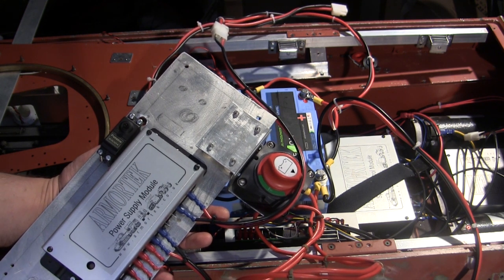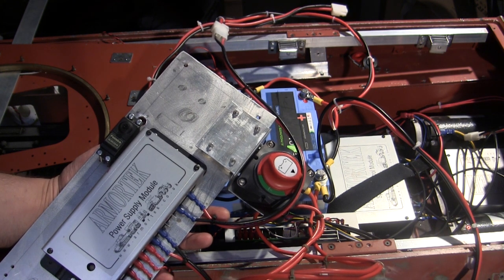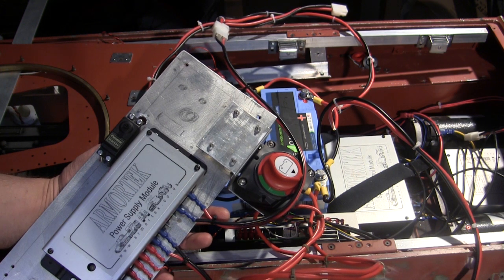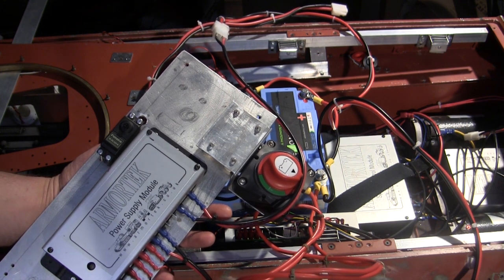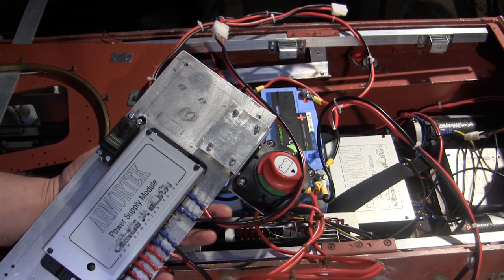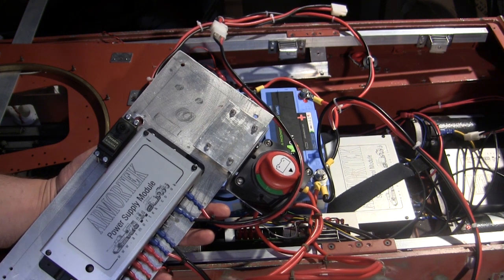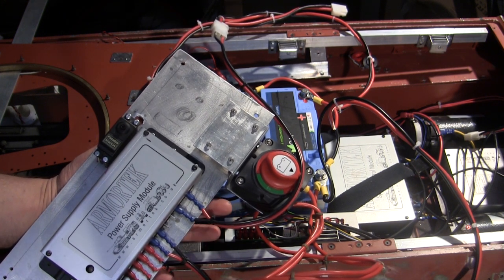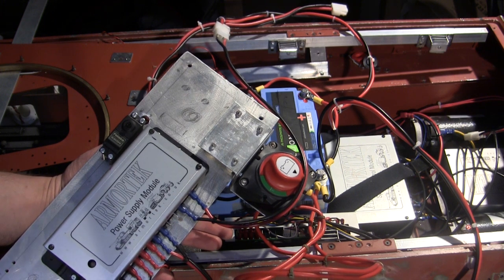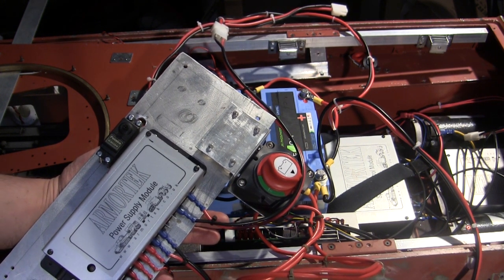Well, in case you accidentally nudge the lever on the radio but you don't want to run the tank with the lights on, there was a main kill switch here, so that would be prevented. However, in practice, that just really wasn't ever proven to be a thing. So rather than going through the extra work and extra complexity of having a kill switch found on the dash, I just went ahead and phased that system out entirely. So this model here is just going to exclusively have the light control feature done and controlled via the radio and nothing else.